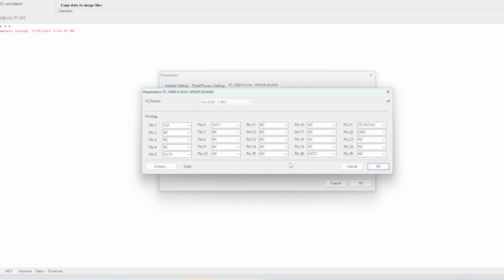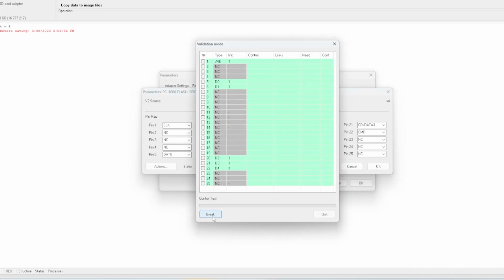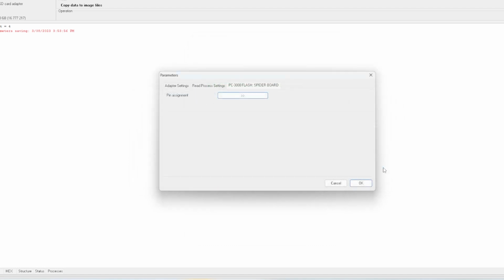It's pretty simple for the secure digital protocol, the SD. It's 4 data pins, so we've got 0, 1, 2 and 3 set up. We've got a command pin, this is what issues all the commands, and we've got a clock. Clocks in computers are like drummers in a band, they keep the time. Let's run a quick test of the pinouts. Make sure everything is working okay. Okay, that looks good, so we can set that.